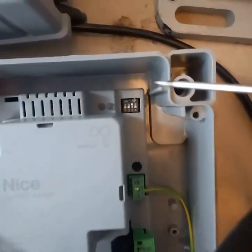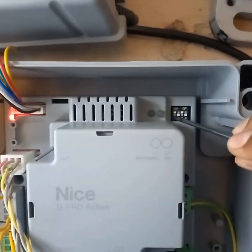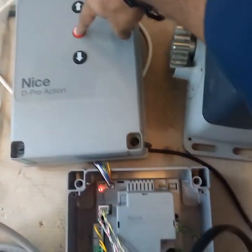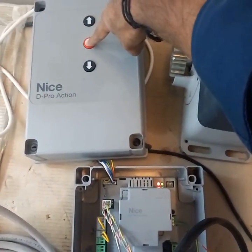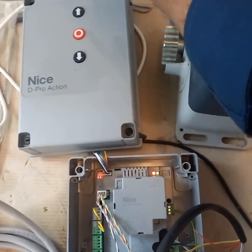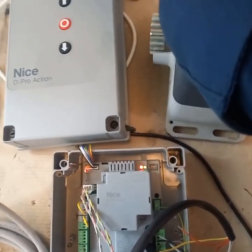For completely resetting the control unit, you need to switch on DIP switches 1, 2, 3 and 4. After that, press and hold the stop button — the light will go stable off, then when you release your hand it will start flashing.